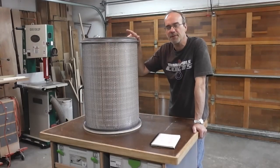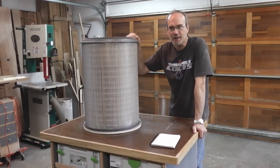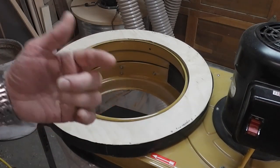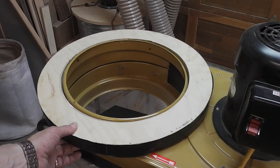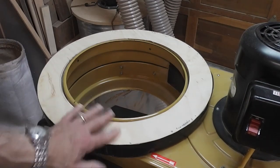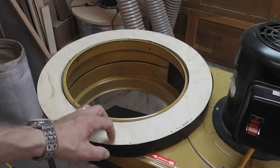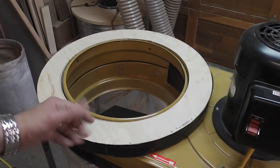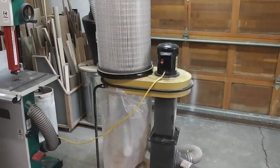I had to do a couple of things to make this fit on there. I don't want to get into a whole tutorial on how to mount one of these on a dust collector because it's going to be a little different for everybody. My particular dust collector has a 14-inch rim and the cartridge is 14 inches also. All I did was build it up with two pieces of plywood glued together with weather stripping — this is very well sealed. I take the cartridge filter, put it on top, and there's a flange on the end that I just screw down. There's also stripping underneath to seal the cartridge to the base.